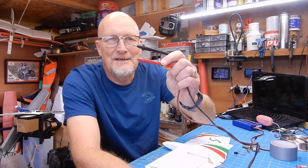So I've got some good news and some bad news. The bad news is the first two that I tried to solder together — the soldering went beautifully — but I accidentally touched one of those across the connector, it joined the two and the battery went pfft, and that was it. One of them's showing 1.95 volts and the other's showing 2.75. The 2.75 I might have another go at trying to save, but that was my own mistake.